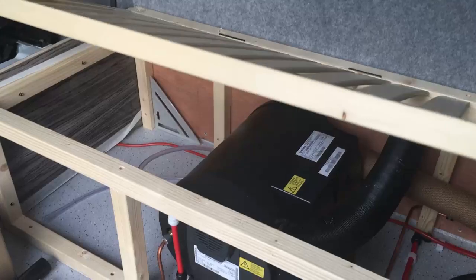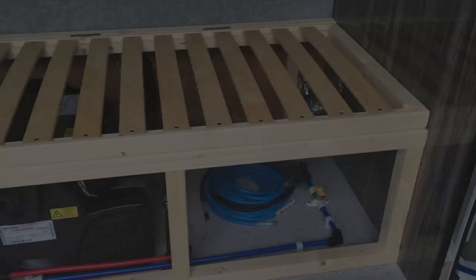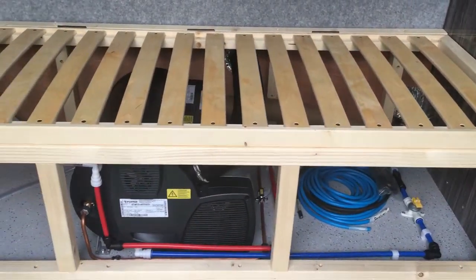The hinge part of the bench seat and the vertical support legs are both fixed to the ply lining of the van, transferring the weight onto the floor. All that remains is to clad the bench seat with furniture board. So there we go guys — the structure of the bench is complete. Really pleased with how strong it is. Super simple construction and very cheap materials — the 2x2 timbers cost just over £10, the bench slats from Ikea were £15, and with about £5 on hinges and hardware the whole bench seat came to around £30.